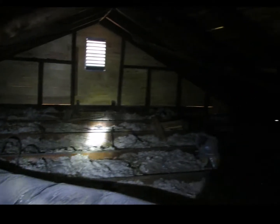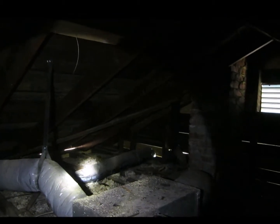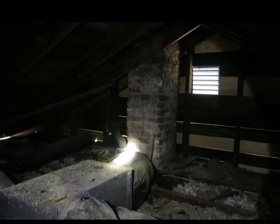Pick up the debris, seal the holes, properly cap off these supply ducts. Be nice to change out at least this one flex. They have bathroom exhaust already upgraded and a large hole for the vertical riser.